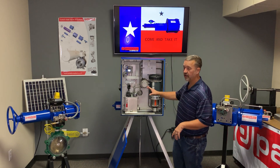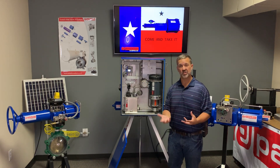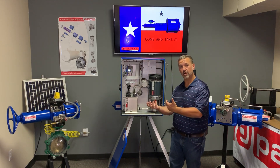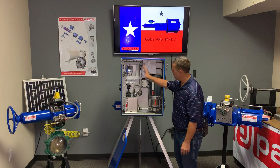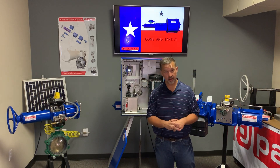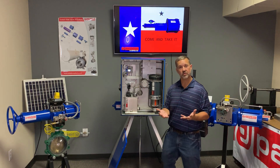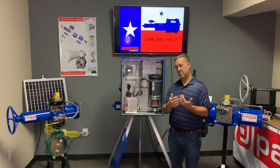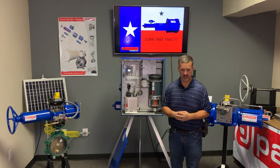This enclosure is typically the exact same size all the way up through a 20 inch, 600 pound ball valve. For 24 inch and larger, the enclosure gets a little deeper for a larger reservoir, but the components are the same, allowing standardization for the operator. Another built-in feature is partial stroke test — a great feature if you want to prove that something works and partially stroke a valve without disrupting the process it's involved in.